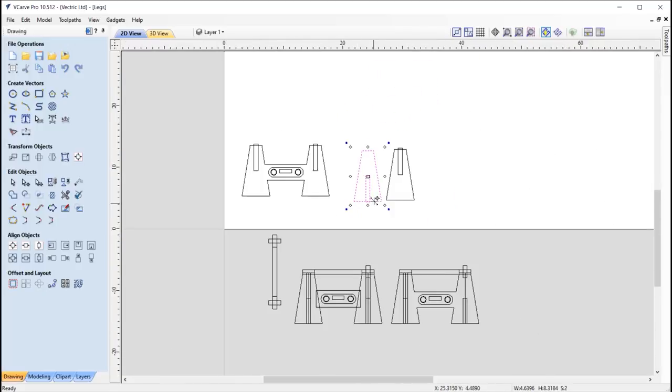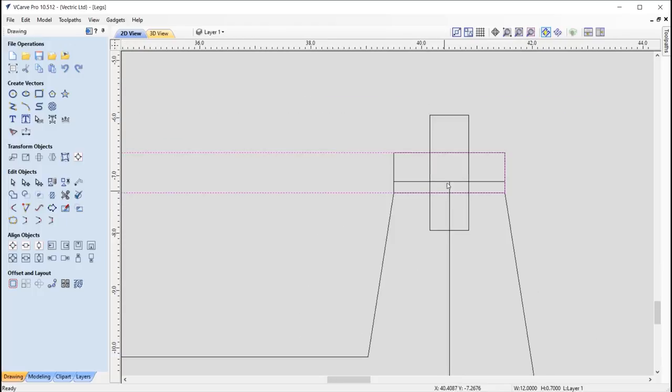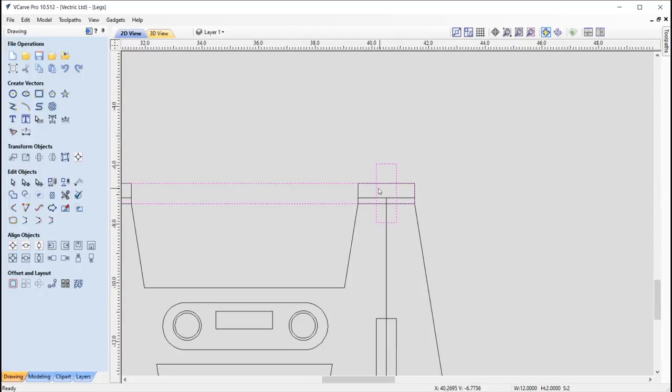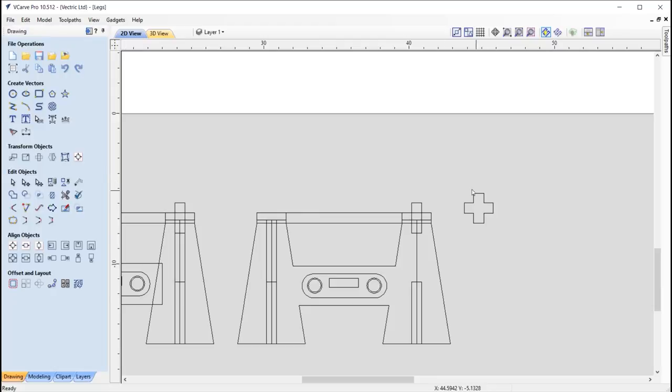And then how that slots into the base is pretty simple. So this rectangle here represents the laptop top, the top of the stand itself, as if we're looking at this side on. And so you can see here we've got a height here of 0.7. And so the idea is we're going to have those legs slot in somewhere underneath, and we're going to slot them into a cross position, because obviously we're going to have two parts that are going to slot together like so, and it's going to form a cross. And so we'd take this kind of shape like this, and then they would slot in place once we've just welded those together. Okay, so it looks something like that. And then we'd also fillet out those internal corners so that the stands can slot in there.